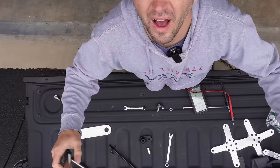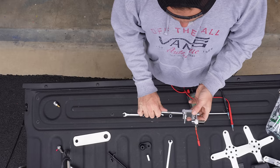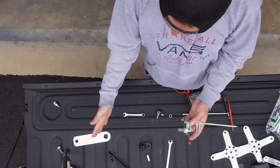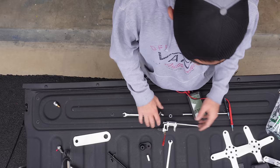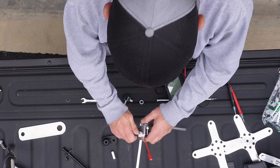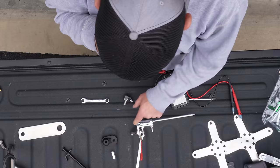This little white washer is preventing the antenna portion from being conductive — it's separating the antenna from the radials. We tested continuity from the tent spike to the L-bracket shield, which is the inner shield, so that's good. We don't want the antenna to have continuity with the radials — they're two separate things. No continuity between them is a good thing.